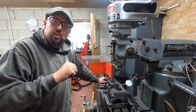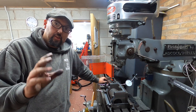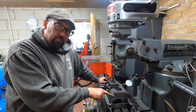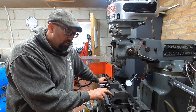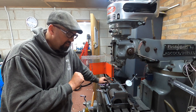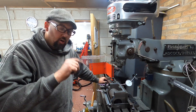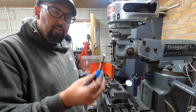Greetings, back in the workshop working on the cylinders. I've just dialed it in so we have the datum edge, because before we start machining the bore we have to put in the drain cock hole which goes here. It says we need to do a bit of spot facing, but I've decided I'm going to machine these nice and neat. We have a distance from the top down, so we're going to machine them off and then get the drain cock hole in.